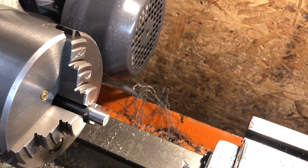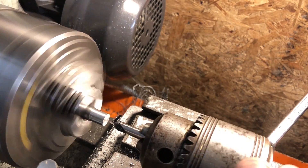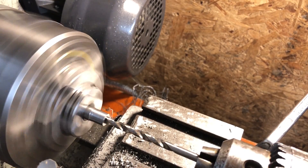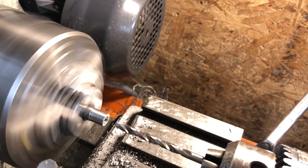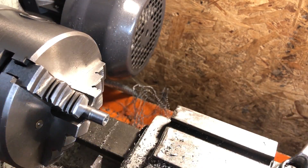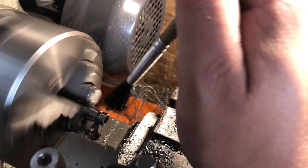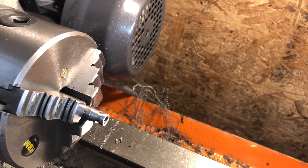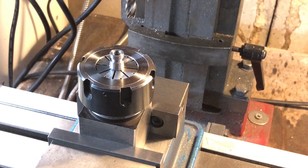Finally for this assembly is the clamp disc itself. This is essentially a thick washer which is turned to diameter with a 4.2mm through hole and an 11.32 counterbore to fit over the nut body. The depth of this counterbore is fairly critical as it needs to completely accept the length of the nut but not break through the relatively thin clamp piece. With that done the thickness can be dialed in, a generous chamfer added to what will become the top of the part, and a countersink formed. Before this is finally parted off there are a couple of features that need to be added to it, so let's take it over to the mill.